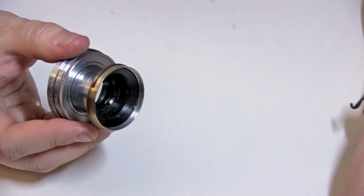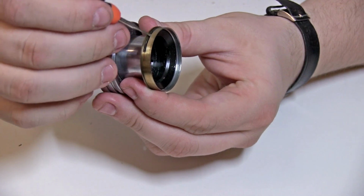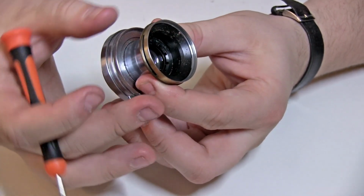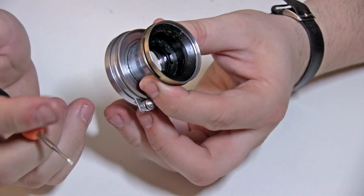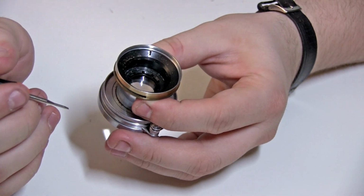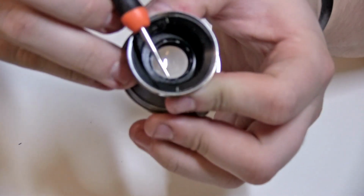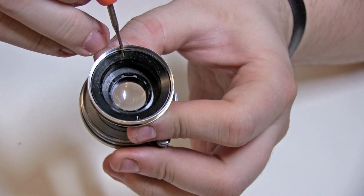The two screws you just removed, they basically follow a guideline which is on either side, and the screws are what basically holds the aperture ring from going too far, and the screws are basically lined up with the two notches in the inner barrel ring.